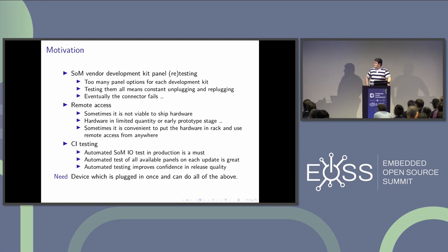A colleague suggested that if I could capture everything — the whole waveform, the entire frame — we could use it in CI. We could store it in memory and analyze it between software update versions to validate that what's coming out of the device is still the same. Sometimes a software update slightly changes the display interface timing, and display vendors are very sensitive to that. If you're operating their displays out of specification they may not accept warranty returns, so validating this in CI is very useful.